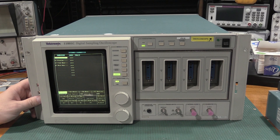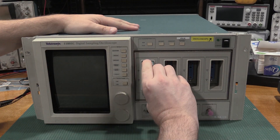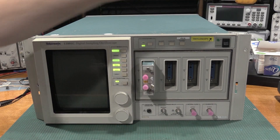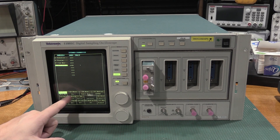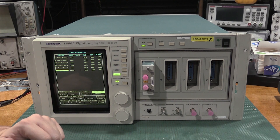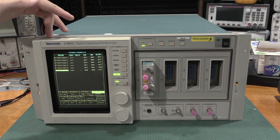That's unfortunate, because that means this frame is probably working and the modules are bad, which is what I was hoping wasn't the case. I'm going to plug a module in real quick and test one. Beeps are bad—it didn't beep before. And we have main acquisition error M1661, which we didn't have before. It says area acquisition one, sampling head, and routine is EEPROM. So this may have a corrupted EEPROM. I'll have to dive into some documentation—it might have ROM rot. We will have to open that up and take a look.